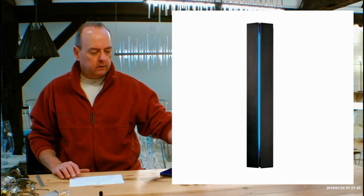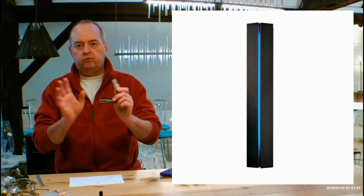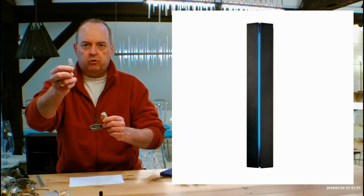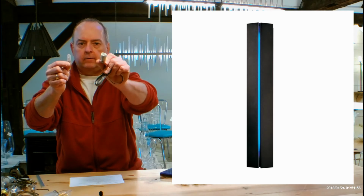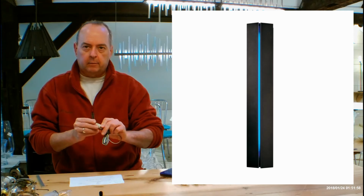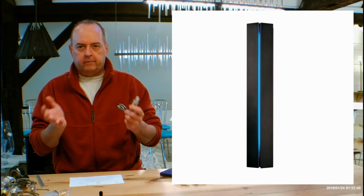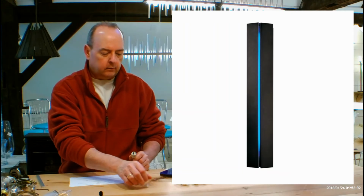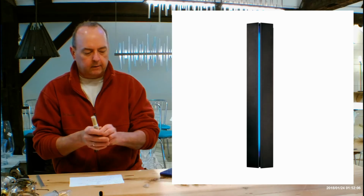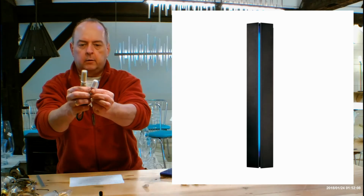It's going to be using three G9, it's actually shipping with G9 halogens, but we're going to get into LEDs in a second. It's going to be shipping with three 60-watt versions of this. It's a G9 socket, very easy. It's a dimmable fixture without a problem. Hubbardton Forge says it's a halogen fixture. It's really not. It was developed before LEDs were available for this socket, and there is a ton of them available in the marketplace.